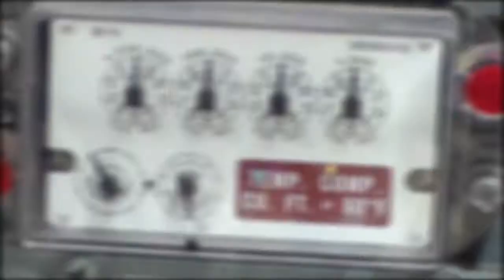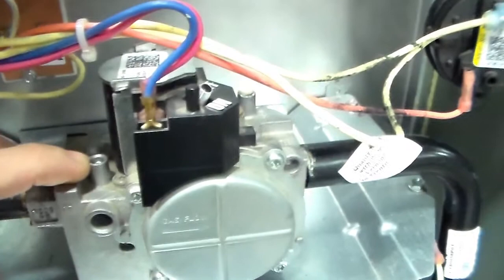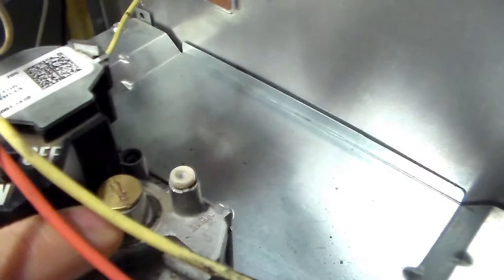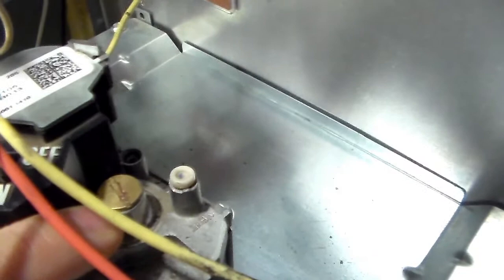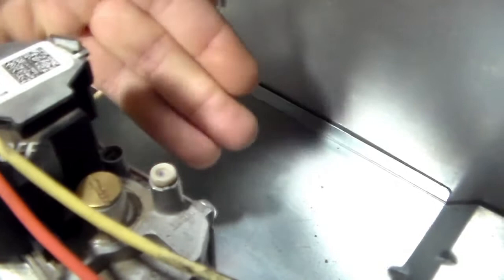They're going to ask about hooking up the manometer and adjusting the gas valve. This stub sticking up is actually your incoming pipe — that's your seven-inch side, so that's not where you want your manometer when adjusting. The stub for your manometer is actually hiding back here behind the solenoid. The brass cap is your adjustment: turn right or in to increase, left or out to decrease. You'll see that change on your manometer.